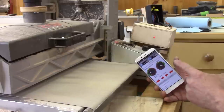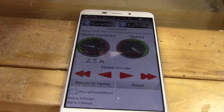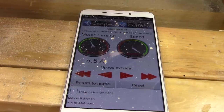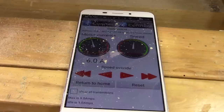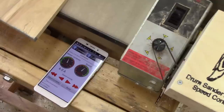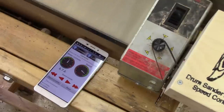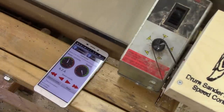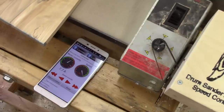And now with the Android app I made, I can control everything like before. Here it's more obvious: when the sanding motor draws more current, the current meter goes up and the speed goes down by itself. It's the same as before, but without any display or buttons. If you want a bit more information on the circuitry and the programming, you can go to my website. See you soon for another episode of The Woodpecker.